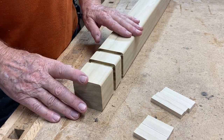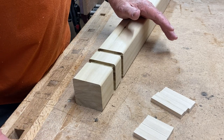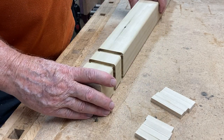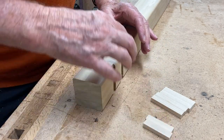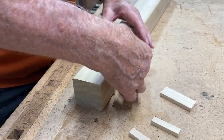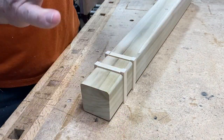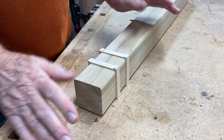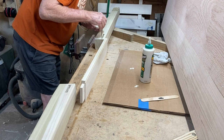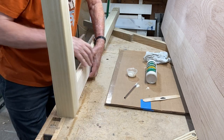At this point in the build I don't know what I'm going to put as an inlay — you already know because you've seen the beginning of the video. I'm going to paint these all white. I've cut little strips to fit down in the slots and I'm going to use CA glue to hold them temporarily. After it's painted, I'll pop these off and decide what to use as an inlay. Now it's time to start the glue-up. I'll glue up the ends first, let them dry, then glue up the long aprons.